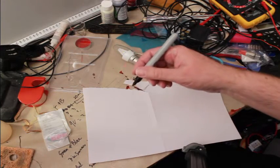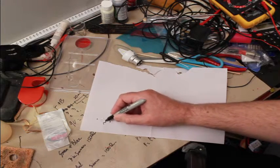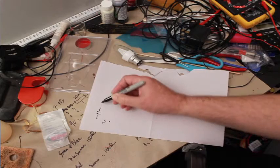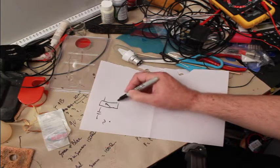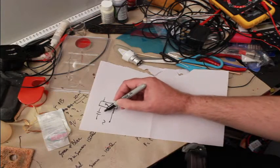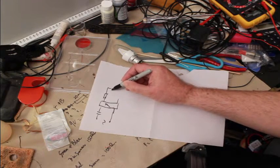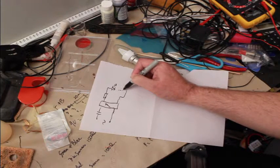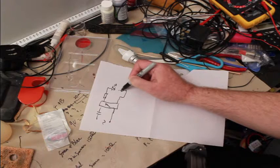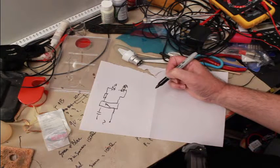It might be. We'll put it on a power meter in a minute if I can find that. No, that'll be another break. Okay. Let's hazard a guess. Let's say we've got mains supply there. Let's lay bets it does something like that through a capacitor, bridge rectifier. That's probably going to be another resistor there. And then onto the LEDs. Whichever way round I drew them. And to that one. In some form. We'll wave a finger at it in a minute.